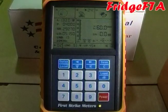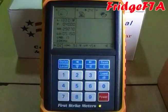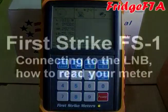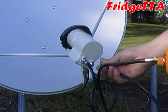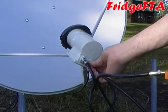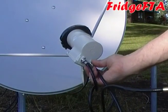To stop or start searching, make sure your little arrow is on the transponder number selection, then press any key on the numeric keypad. To start searching for a satellite, take a short piece of cable — around three to four feet — and screw it from the right port on the meter to the LNB.